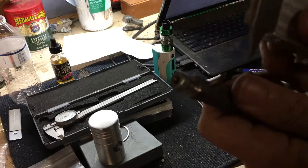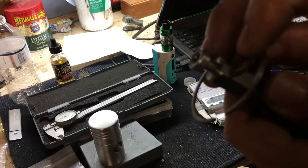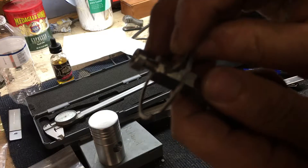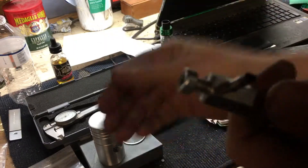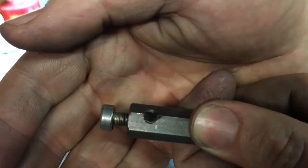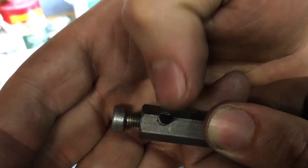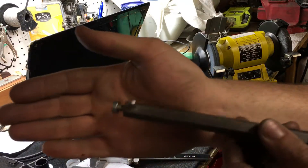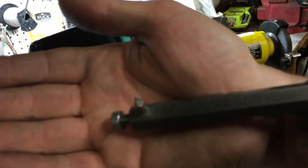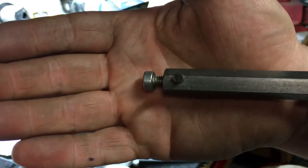I'll set up 59 thousandths. Better yet, I'll take a ring — on the inside, because the outside has a chamfer — and just mark it. I can see two bright spots there. I'm going to go to the grinder and grind up to these bright spots. So just after a couple of careful minutes of grinding, I've created a V shape on the end of this drill bit.